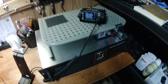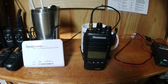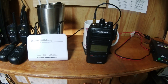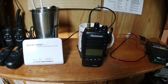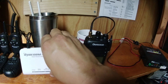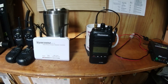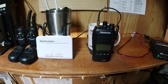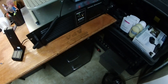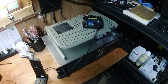For those of you wanting to do a GMRS repeater, I might recommend a poor man's repeater to start off with, especially if you're in very hilly terrain like we are — to make sure you're using an antenna that's going to give you good coverage and that you have the right antenna height. There would be nothing worse than spending twelve hundred dollars on something like this to find out that you don't have good coverage.